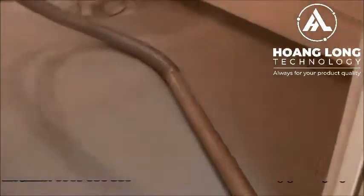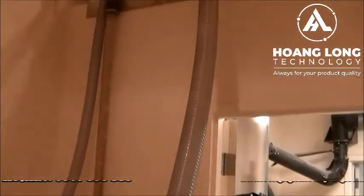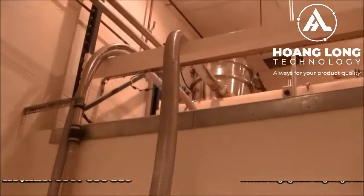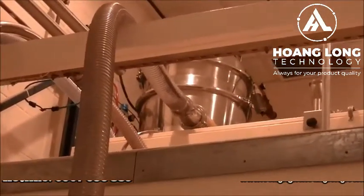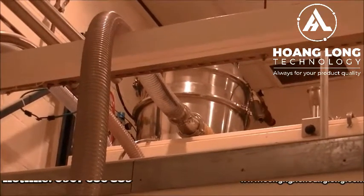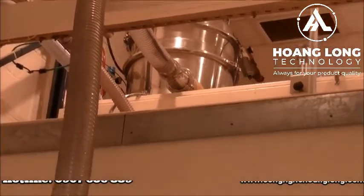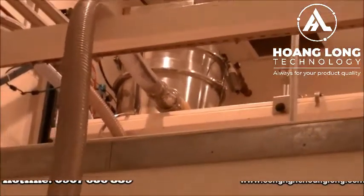Total stainless tubing is about 60 feet. That section of flex hose is about 25 feet. Conveying back up into the flex hose again, the product will convey up to the mezzanine to the PIAB. You can see there's a PIAB up there on the mezzanine with the hose connected to it. Total transfer distance is about 110 total feet, 15 of that being vertical and the remaining being horizontal.